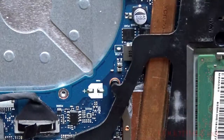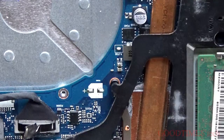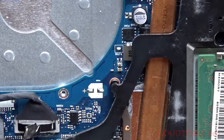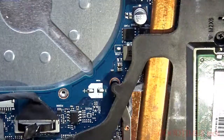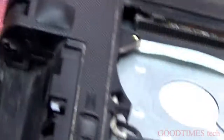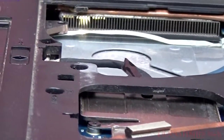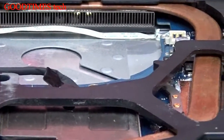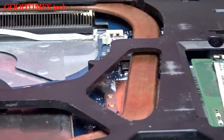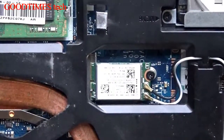I'm going to show you by shining light from the other side. You can see light through the fins — that means the fins are clean and not blocked with dust or any other particles. Clean them in that way so that light passes through, which means air will flow freely.